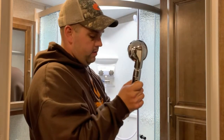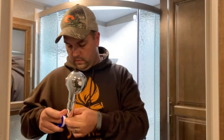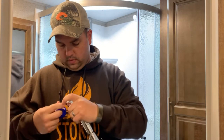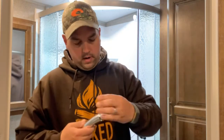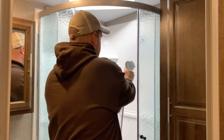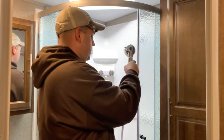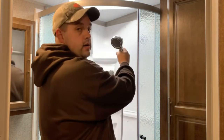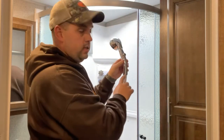Take this little protective cap off. Get your Teflon tape out. Really easy — no tools required for this. A couple wraps of the Teflon tape to prevent any leaks. Wrap that around, super simple. No tools required. One of the really nice things about this is it'll fit in the same showerhead holder on the wall, so you don't have to change anything out. Make sure your gasket's in place. The kit actually comes with a second gasket and screen if you need it, but this one already has one in place so I didn't need to swap it out. Make sure your connection's tight — don't over-tighten it because it's just plastic, so you can break it.